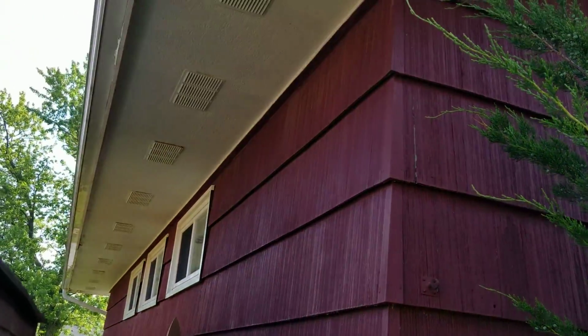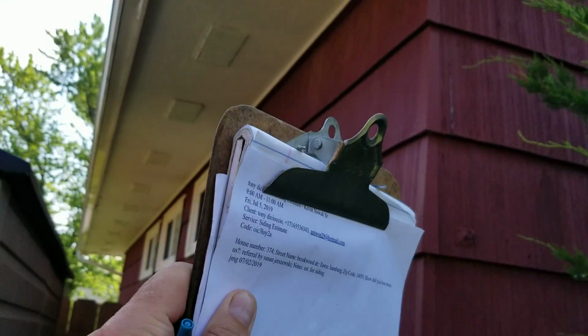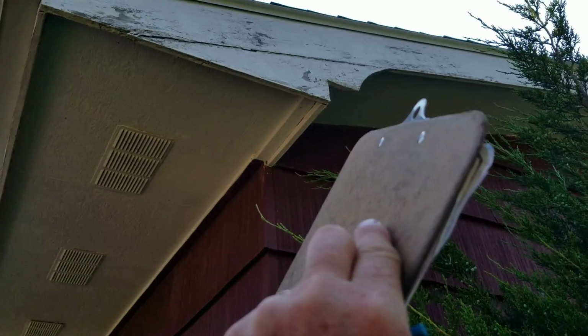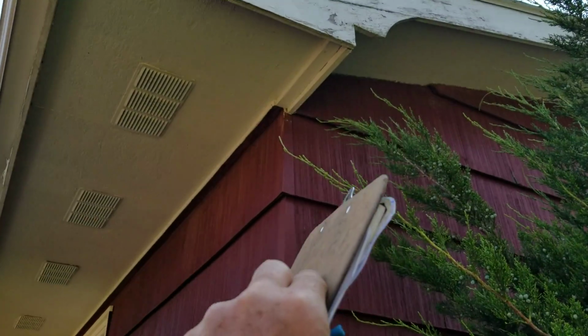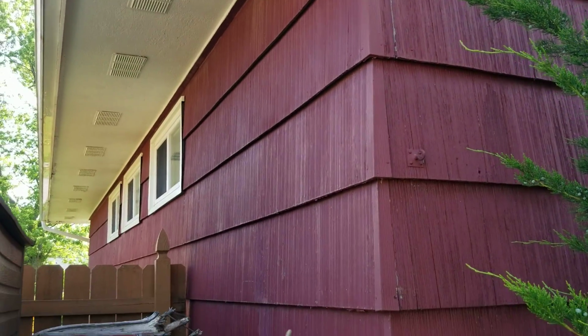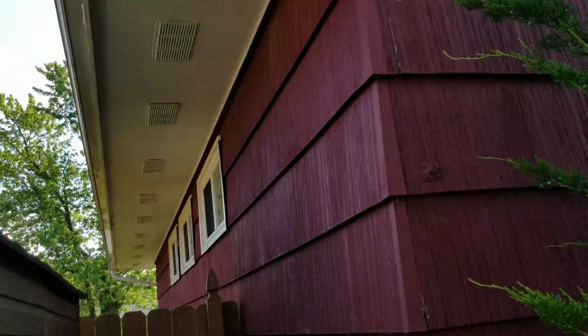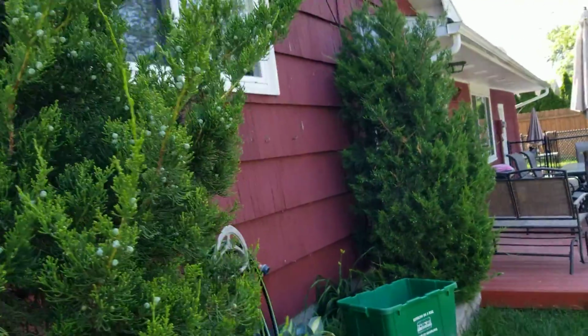We're going to open up the soffits a little bit more and make sure that the insulation's not blocking any airflow. Our bird's mouths are going to be cut squared when it's all said and done, and then obviously we got a big overhang, which is probably close to about 2.5 feet. I'll measure that on the main house.